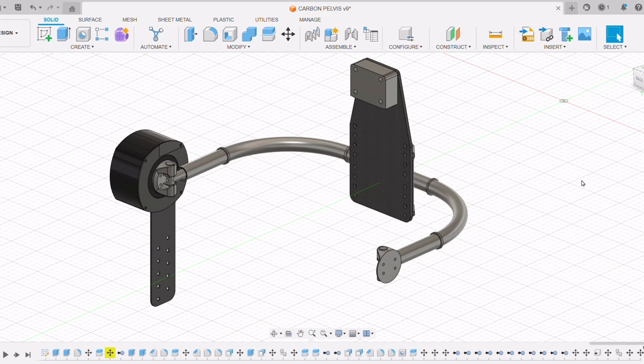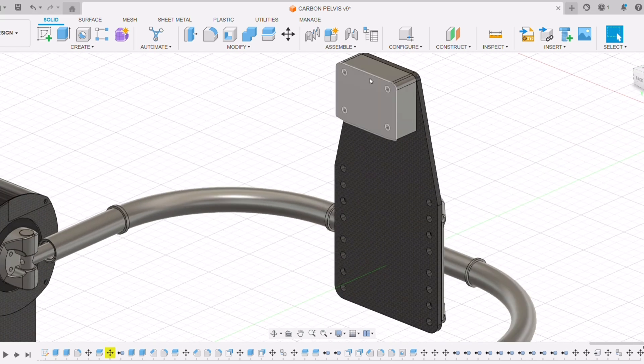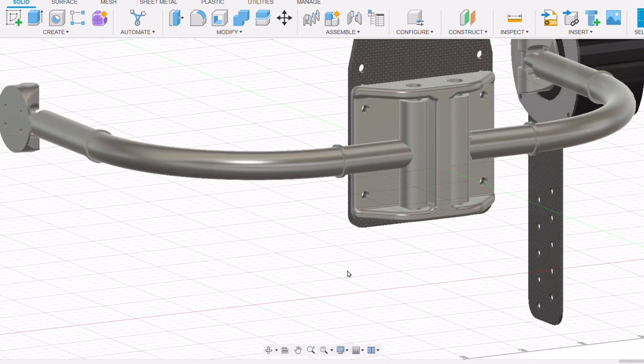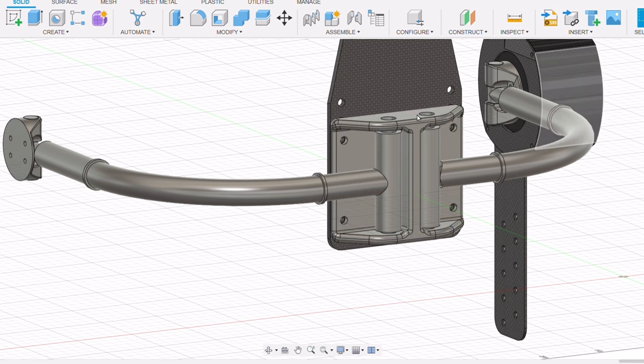Here is what I came up with. From the attaching point of view it attaches the same way as the previous pelvis design - to the bottom of the spine. I've also put a spacer block on because I think it'll need one between the spine and the belt. The main large bracket will be five millimeters thick carbon fiber. If we rotate to the back you'll see the bracket that holds the pelvic arm brackets - this will be 3D printed out of carbon fiber PLA, but I'm designing everything so I can make it out of forged carbon fiber in the future. This is a pivoting bracket with two dowels/bolts running through the middle so the arms can bolt onto them, giving me extra movement I think I'll need.